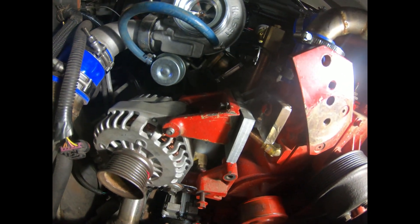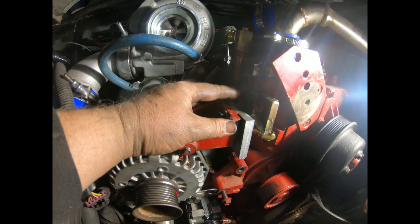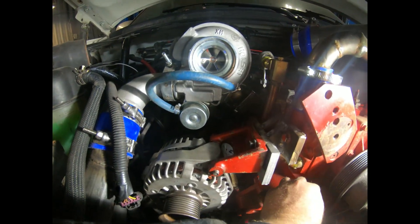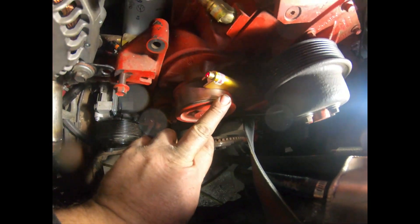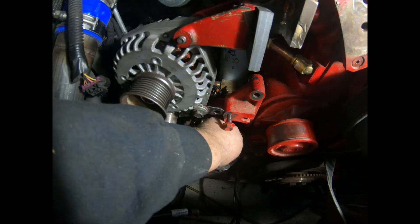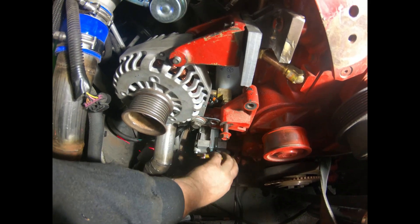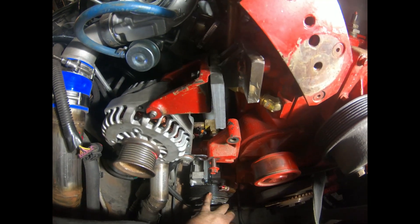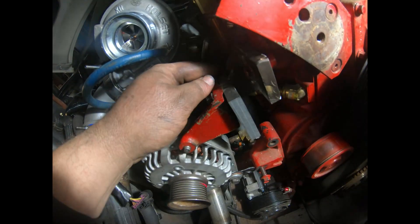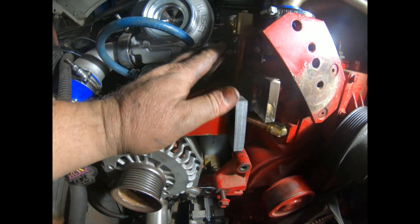It took about three or four tries to line it up properly. I just tacked it, marked where I had it the first time, and moved it back a little bit. As you can see on the water pump too, it's lined up there. That is done now — it needs to be painted. I have to take it off, finish welding these seams, mill all the edges, probably mill this big chunk off on the bottom, finish welding it out, sandblast it, and shoot a coat of paint on it.